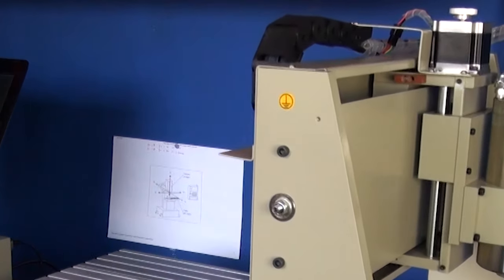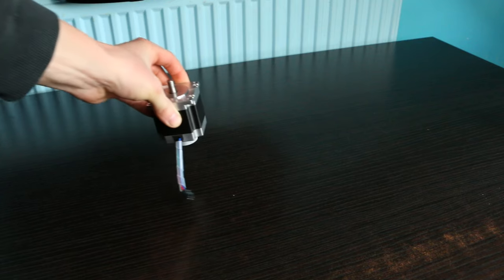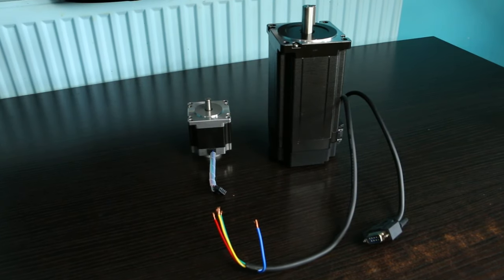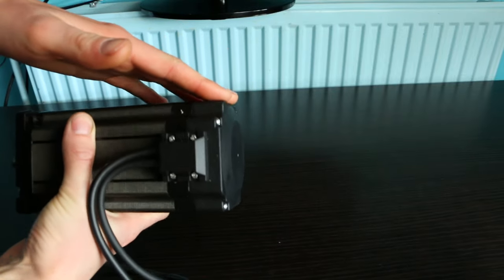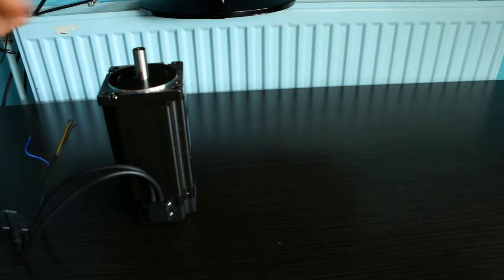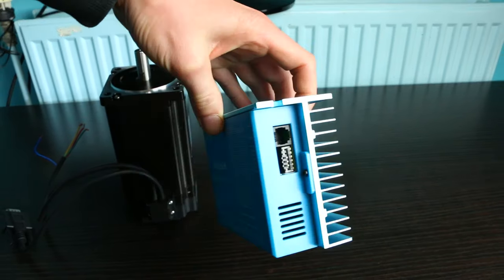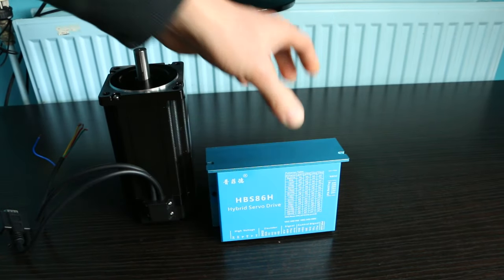For comparison, this is the NEMA 23 motor for my CNC 6040 router, and this is the motor we're going to work with today. This is a NEMA 34 closed loop stepper motor. Closed loop means that the motor has an encoder that together with the driver board checks if every movement that the motor is ordered to do in fact took place. If for some reason the motor lost some steps during a movement, the stepper driver corrects this mistake. A closed loop stepper motor is for this reason more reliable than a normal stepper motor.